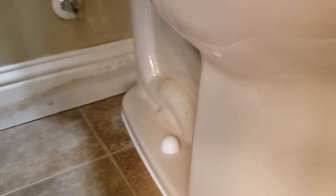We do leave the back open. The reason why is if for whatever reason you do get a water leak down there — if the wax fails — you want a place for the water to escape so you can actually see it. If you caulk it in really tight, it just builds up underneath, sits on the flange and eats away, and you're back to square one. So we leave it open in the back.